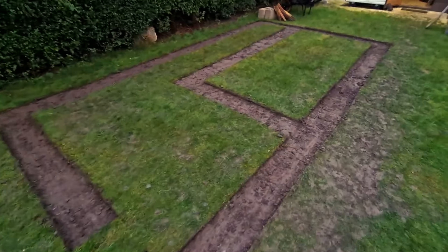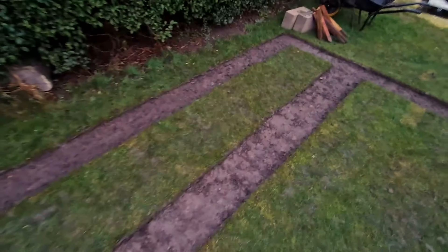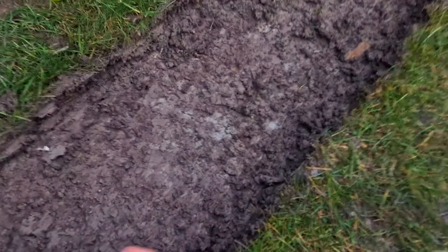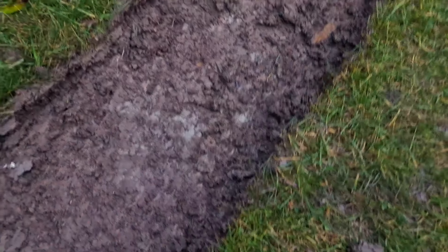Like I said before, I'm not going to be going mad with foundations, because this topsoil isn't that deep before you hit clay. For example, if you look here, I've only scraped the top bit of soil off and grass, and already you can see just here — this is blue clay. That's blue clay, so that's what I mean — I don't need a mega foundation for this, because the clay underneath here isn't that far down. And once I hit that blue clay, that'll do me, I ain't going any further. And it's a bugger to dig — these have been studied for ages.